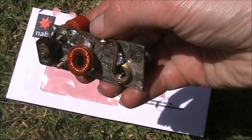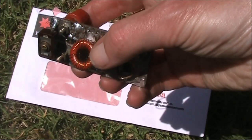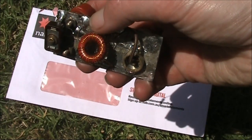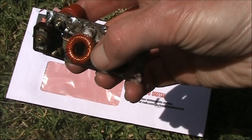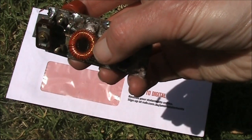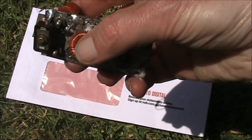Unlike most of my other couplers, which are L-matches, this one is basically a transformer with two windings on a T68-2 toroid. RF is applied through the primary of about five turns — you might want to vary it by one turn either side, depending on the match you get. The secondary is 41 turns.